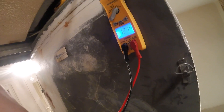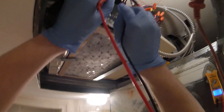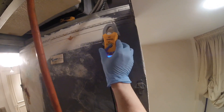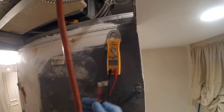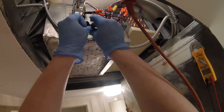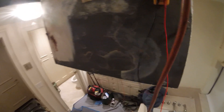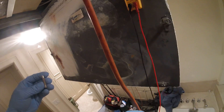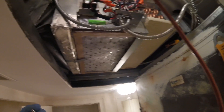Let's check incoming power — we have our 120 volts. When we measure across the next two terminals, we have nothing. It's a bad transformer. I do see an inline fuse — let's set the meter to continuity. Short it out so we know we're good. We have a good fuse, input power but no output power. That's a bad transformer. That's why that valve is not operating.